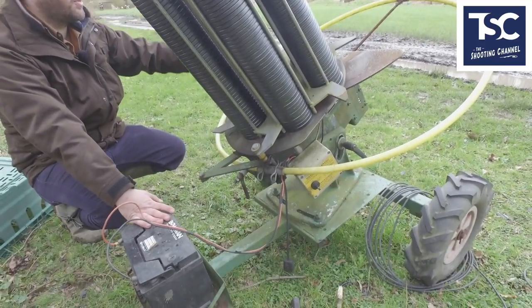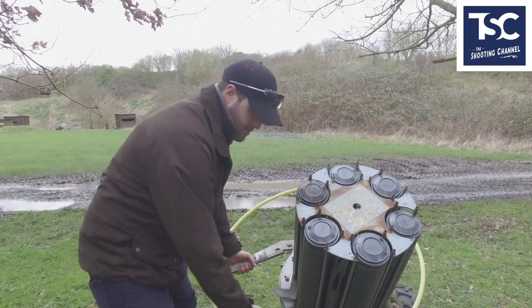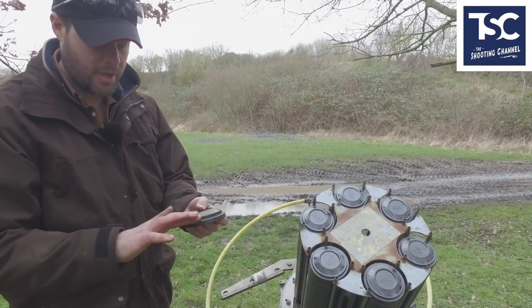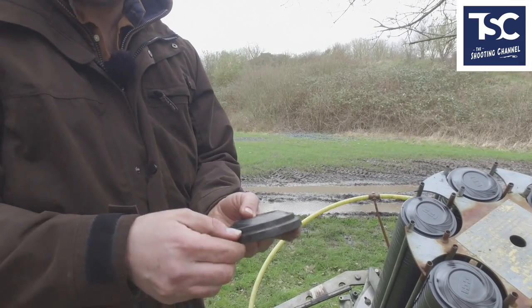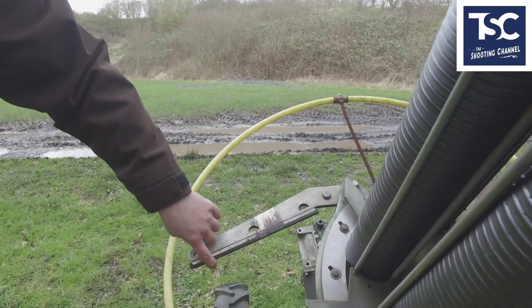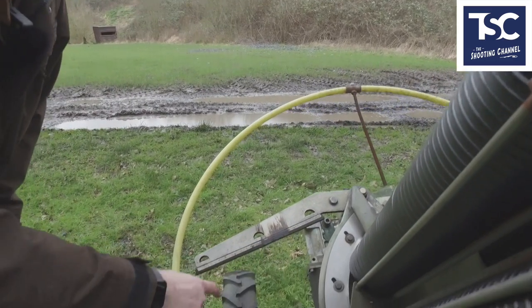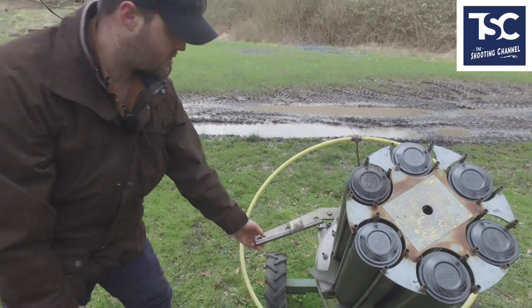Battery maintenance is a really important thing, and transporting is another. If you don't know how to lift a trap, you might grab it in the wrong place and bend the arm. We set it so it engages on the driving band of the clay at the perfect height — if you sprag that arm up it'll run over the clay, and if it's spragged down it'll just pinch and break the clay. Protecting the arm is a big thing; it is a perishable item and will wear away over thousands of clays. But you can undo the nuts, flip it over once, and use the second side of the arm before you need to buy a new one — so you do get good longevity out of those.